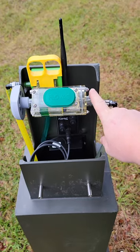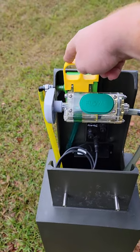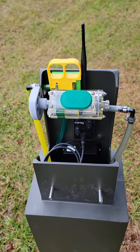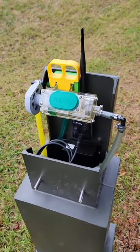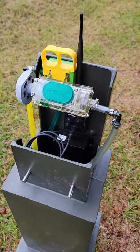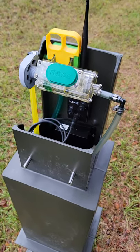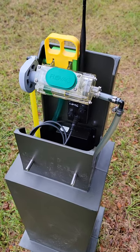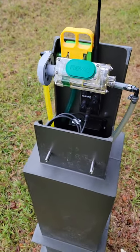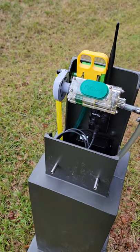Make sure you've got your hose clamps, especially on your sensor side. There's a nice big slip key there to remove the controller and work on it if needed. That's a pretty good option for those of you that want to get the controller out of the valve pit — fairly straightforward to do. You just need three vacuum hoses running down into that valve pit, and potentially, depending on your setup, a 5/8-inch hose to allow the lower section of the valve to breathe as well.